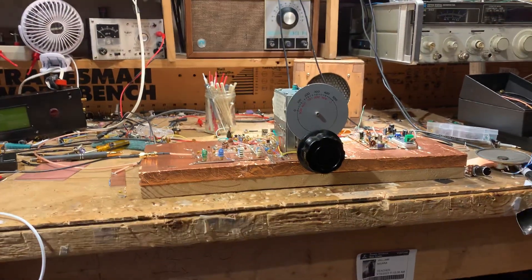Audio comes over here. There's one little stage with a 2N3904 that is like the preamp, and then from there I go to this little board — it's an LM386. There's the LM386 surface mount. You can get these on Amazon or eBay, and they're about a buck a piece. It's very convenient because you don't have to mess around with soldering the surface mount LM386 onto the board. I use a lot of MeePads in here — it's kind of cool to include some of Rex Harper's products in the project. The base of the project is a pine board, and I've covered it with copper tape that I got from Home Depot, which provides a good ground plane.